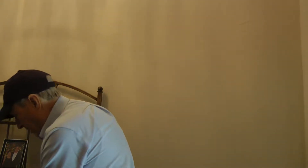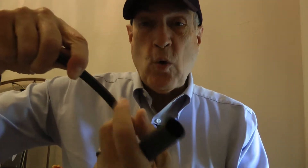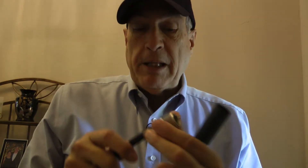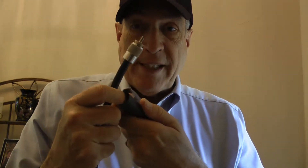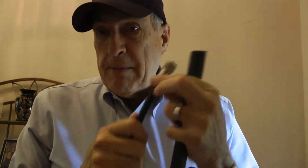One of the good things about heat shrink is when your coax is outside — which most coaxes are — you want to keep water from going down into the coax. That's why we have heat shrink. It's also good for indoors simply because it gives reinforcement. There's sort of an adhesive when it's heated up that sticks to the coax and to the connector, so it will be a little bit harder to pull out accidentally if it's not soldered well or something like that. So it gives it reinforcement, keeps the moisture out. It's really a very good product.